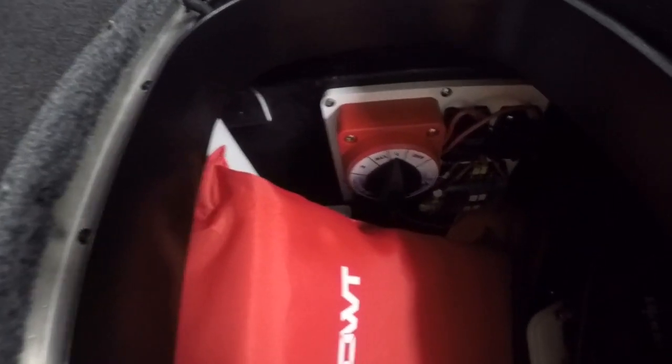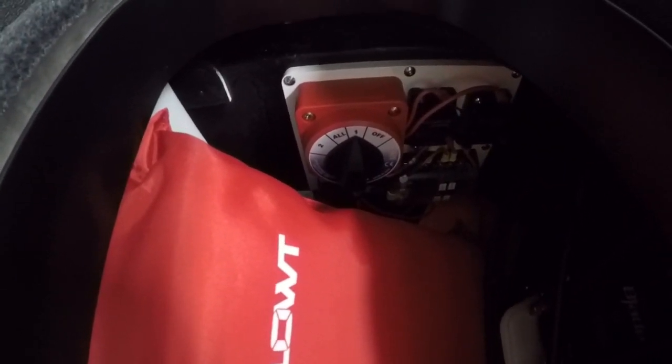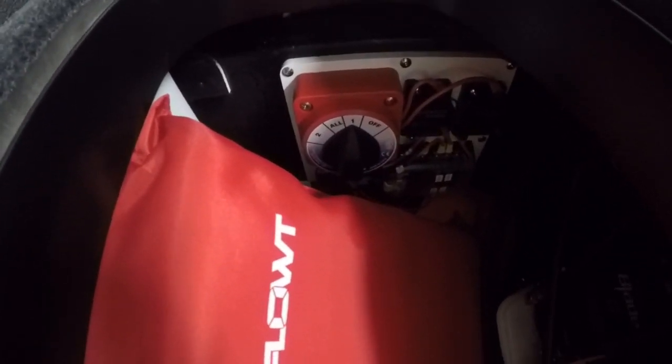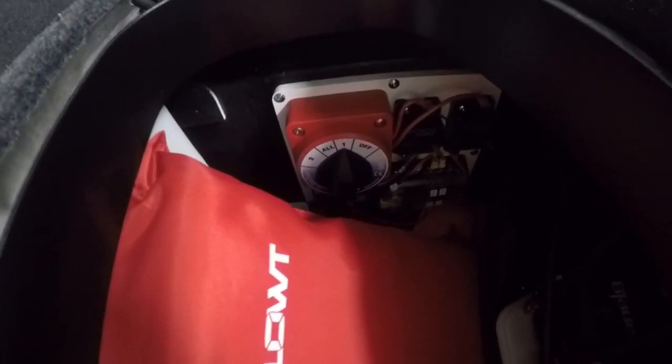So back here, you've got this new Perko switch, which allows you to jump start the trolling motor batteries or run all of the power for the boat off of the trolling motor batteries in the event you have an issue with your starter battery. So that's pretty cool. Mounted the power pole pumps down here. I keep my throwable and my tools back here, paddle. Got a 31 AGM down there. Minn Kota precision charger. All this is clean, easy to access.